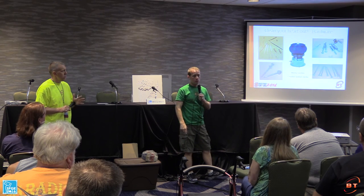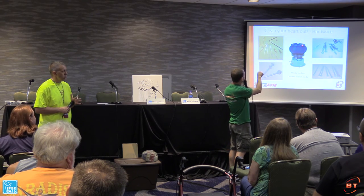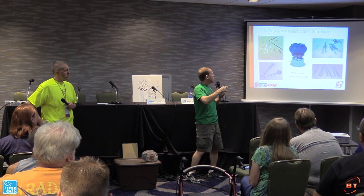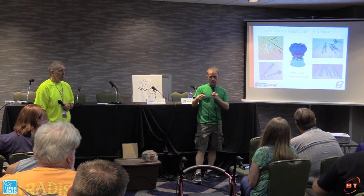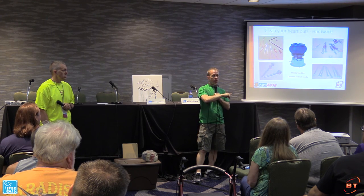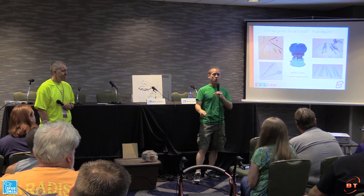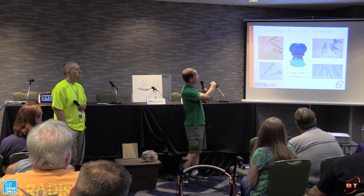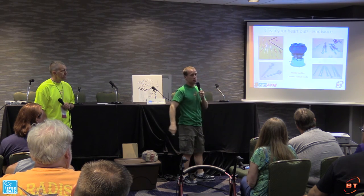So what I'll do is put all the hardware in the tumbler, and I'll let that tumbler run several days. This type of tumbler is not vented, so you get a little dust, but you don't have to worry about dust everywhere. I actually put a smoke detector in my laundry room, which I should have already had, because I knew it was going to be running. I never leave it running when I'm gone, but I'll let it run through the night anytime I'm at home. I'll give it a good 24 to 36 hours running all that material, and it will come out nice and shiny and squeaky clean, just like you see there.